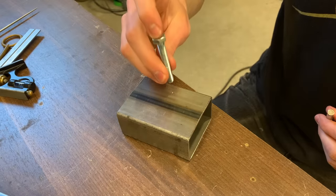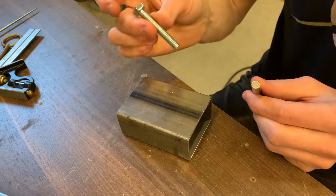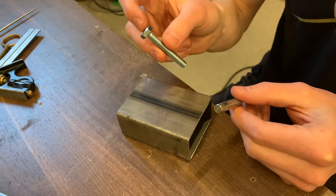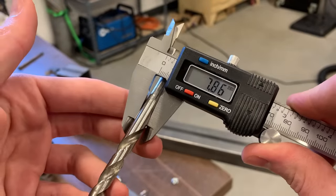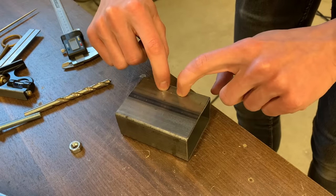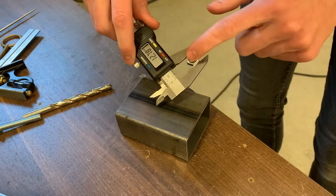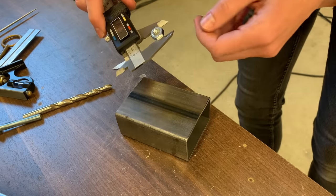Once you've decided where you want the bolt to be, you need to drill a hole just barely big enough to fit the bolt. Don't oversize this — you don't want a lot of clearance around the bolt, you want it to just barely fit. Bolts are typically a little undersized; this M8 bolt is actually about 7.8mm, so I'm using a 5/16" drill because that's the smallest bit I have that will still fit. The distance that the smaller holes need to be from the bigger hole is one half of the nut's flat width plus 2.5 millimeters or one-tenth of an inch.